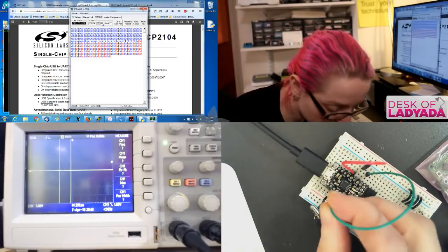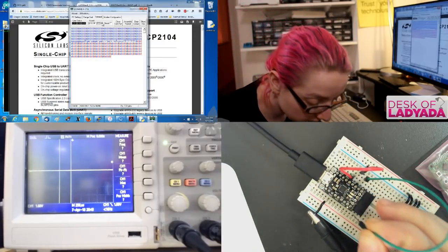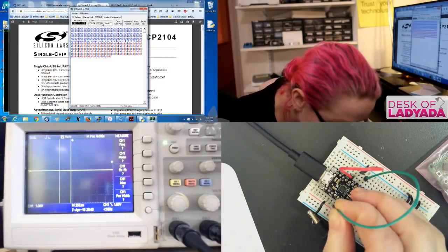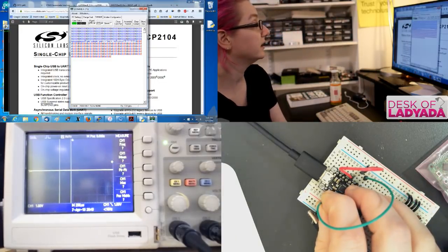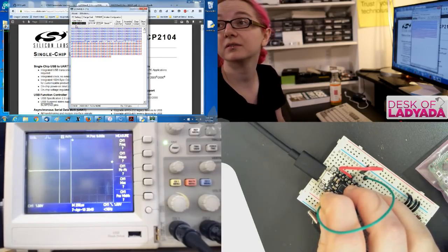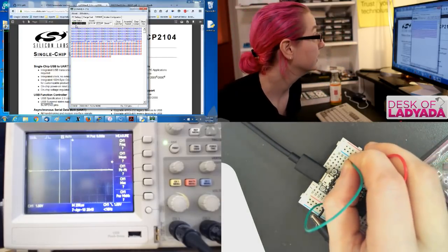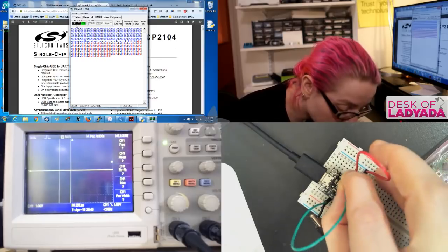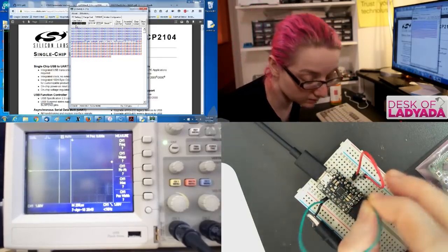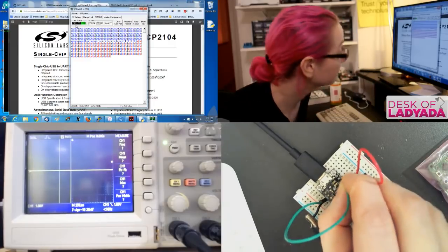But if I connect it to ground, which one's the ground pin? Oh, here you go. You'll see over here on the computer, this little green thing turns on and off. So it's just telling you, hey, that signal got input. There's also DSR, all these modem lines, all 9-pin connector of them. See DSR on and off.